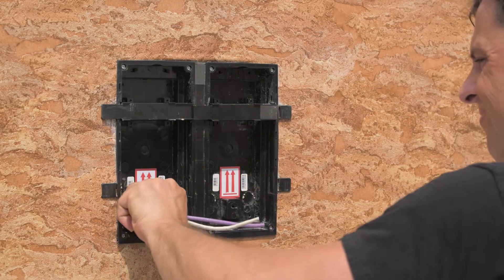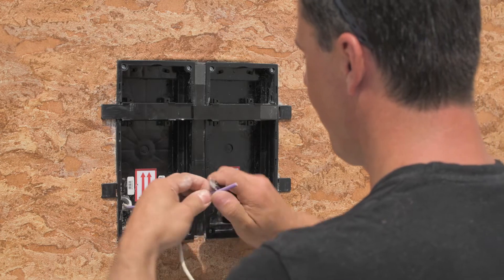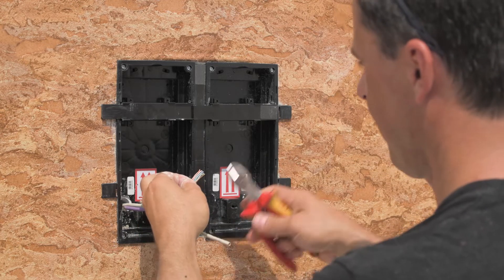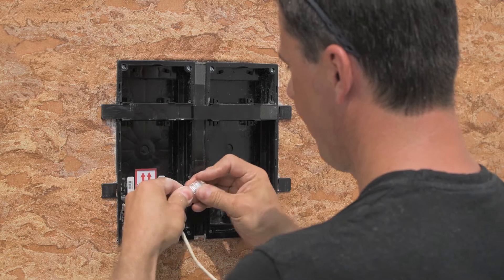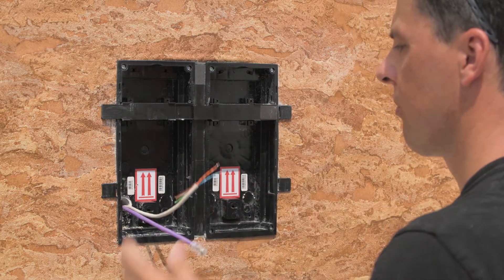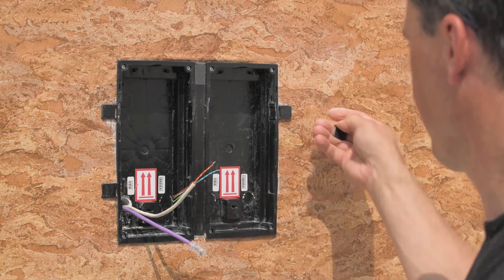Cut away unnecessary gooseneck sleeving. The cables will most likely have to be crimped and adjusted. Here we've got two cables: one for PoE and the other for door strike connection. It's a good idea to leave a bit of length on the cables to allow for future adjustments — just fold or coil away the slack in the installation box. Take out the separators and break off the outer anchoring brackets.